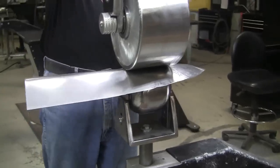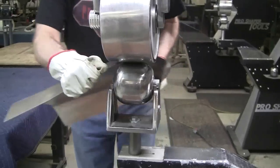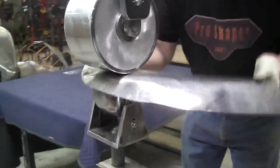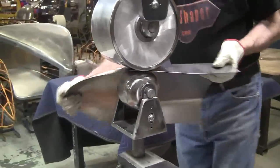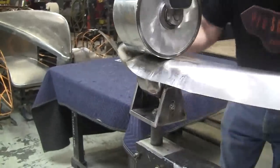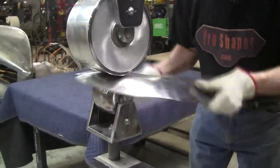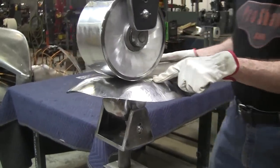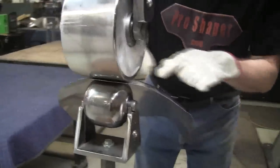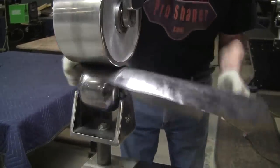We're going to bump the pressure up now. We pull down on it as we're pulling out. That gives it like a little fulcrum effect there. We're still smoothing and we're stretching a little bit here. By stretching in board here, it'll actually make that come around some more. We want to confine it to just that radius there on the end. If we get up into here, we're going to have to stretch a little bit, but not so much.